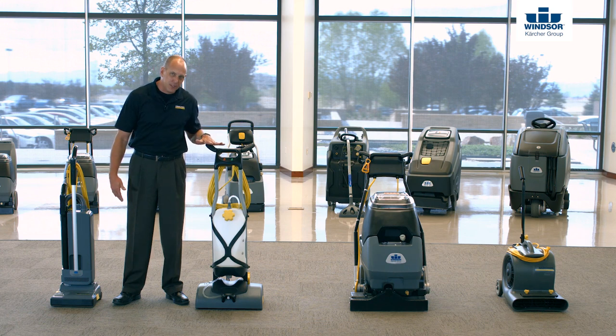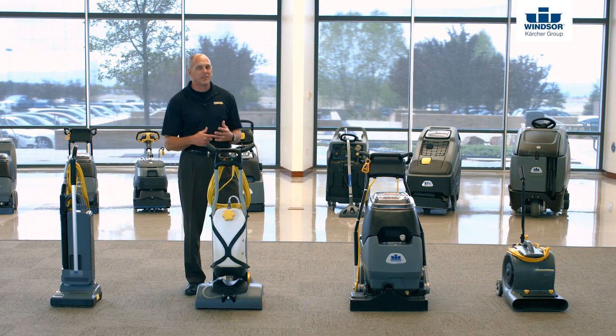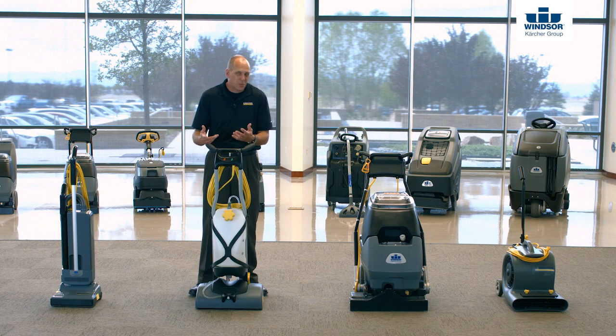The second step is to apply our pre-spray. Now yes, there are a lot of folks out there using a one-gallon or even a two-gallon pump-up pre-sprayer, which actually works okay, but it doesn't work as well as this machine — and here's why. This machine comes standard with a 50 psi pump. It has a fixed jet and is angled perfectly every time. Underneath, we have counter-rotating brushes, which are designed to actually lift the nap a little bit so we can get all the soil down in the carpet to the top and get it out. Trust me, that will keep your carpets fresher a lot longer.